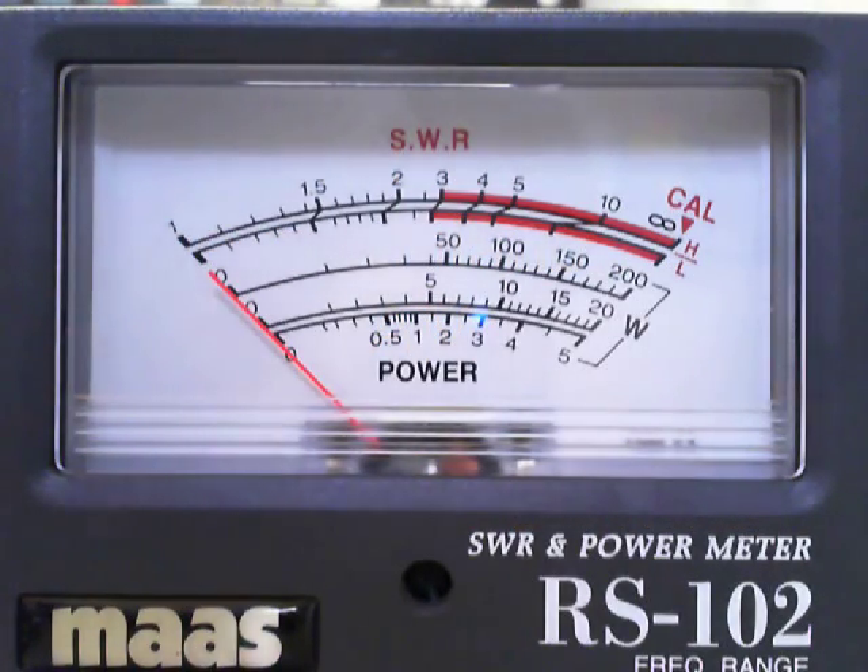Number 1 is the source — about 12 volts — directly from the power switch. Pin number 4 is connected to the power switch. The modulation amplifier is also very strong here. We will test it — key and modulation will send now.